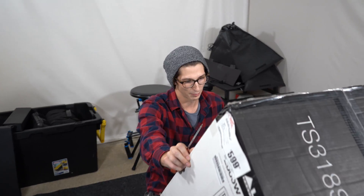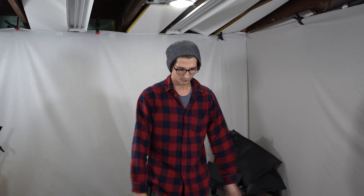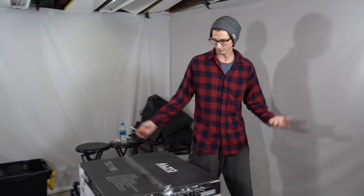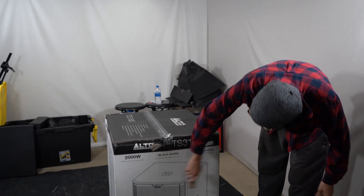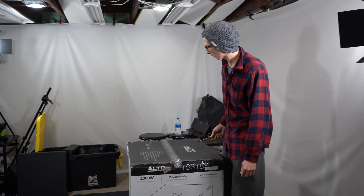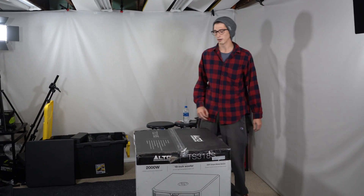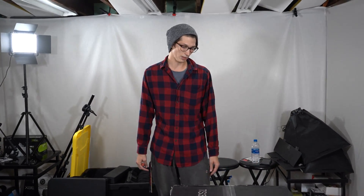The dimensions are 26.8 by 21 by 24 inches — roughly a 2 by 2 by 2, about 6 cubic feet. It's supposed to have giant ports, two of them on the front. We're comparing this to the QSC 181 even though it's half the price. If it can do at least half the performance we'd be happy, but we're really going to see if that 1,000 watts RMS claim is true.